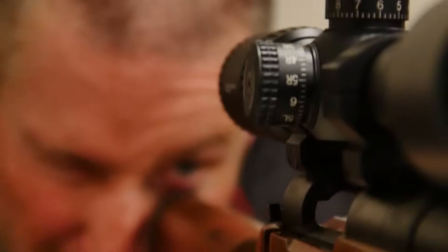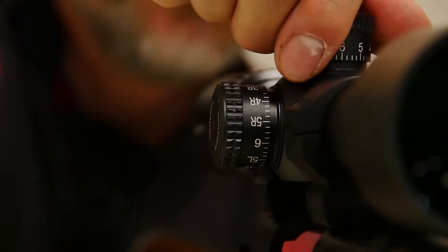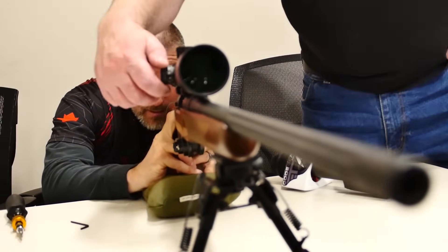I'm going to get a little bit more magnification so I can see the reticle, and we're going to work on this together. I'm going to be back here at the bore going up and down with my head, and then I'll ask you to turn the turret. What's interesting is I might ask you to come up, but you actually go down — that will move my reticle up. It can get a little confusing. Although the turret says 'up' and I dial up, what it's doing inside is taking my reticle and moving it down, going in the opposite direction. So if I say up, you go down. I need you to come down. Keep going, and stop. Come right — so turn your dial left.